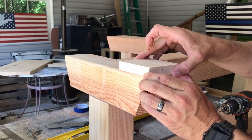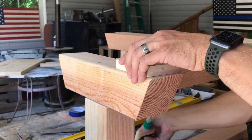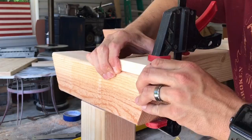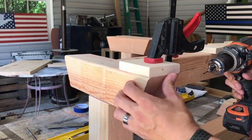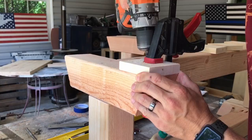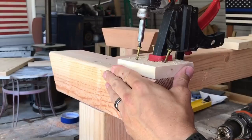To put these feet on I use glue — I always use glue when attaching wood to wood. Put a little glue on it and take these little quick clamps to get a little light pressure, just enough to hold it in place while you screw it down. I take a countersink bit, make sure everything is flush on the sides so it all looks square, then put two countersunk holes on the back and one on the front. Don't get too close to the edge or it'll crack — about a quarter of the way in. I tilt it at the same angle and use inch-and-a-quarter screws. Then I do that on all the other three sides and use a quarter-inch round-over bit on the edges of the feet so everything doesn't split and it doesn't scratch floors.